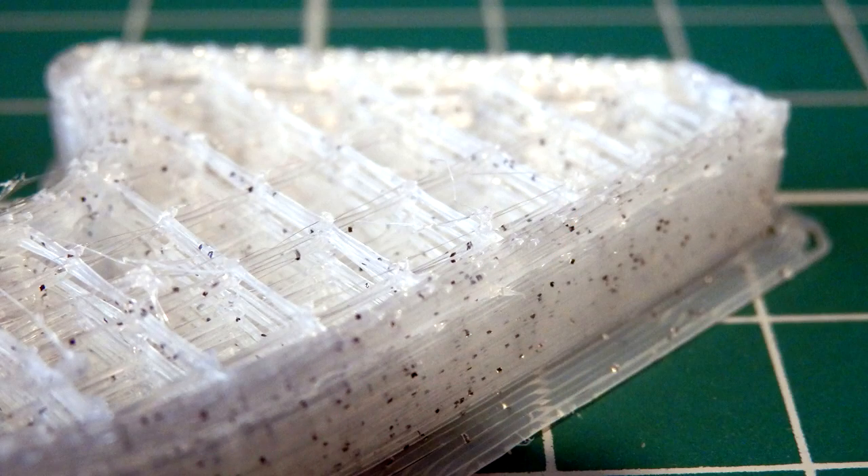One way to test it: if you get problems like this one I've been saving to show you — the first five millimeters prints perfectly fine, and as it moves further from the heated bed you get less heat, and your fans are probably on after the first layer so you're cooling the part more. Sometimes that's enough to tip over the edge — you're putting too much pressure on the hot end nozzle because there isn't enough heat, so the extruder ends up grinding the filament and can't push it properly, sometimes slipping, sometimes pushing.